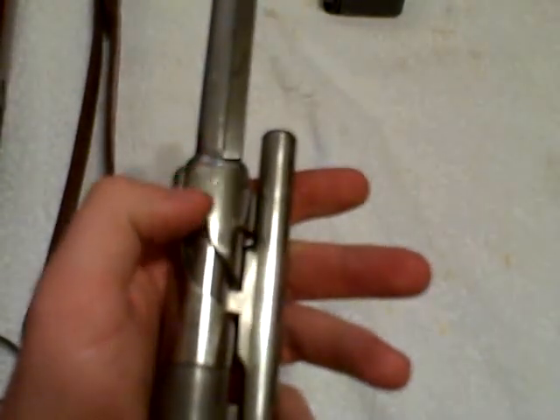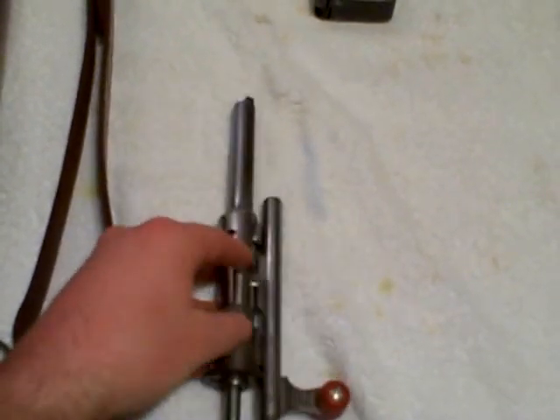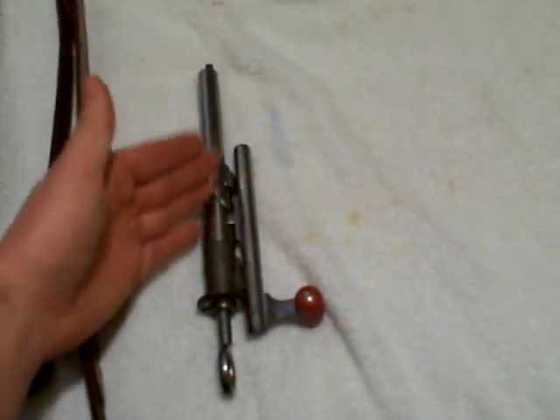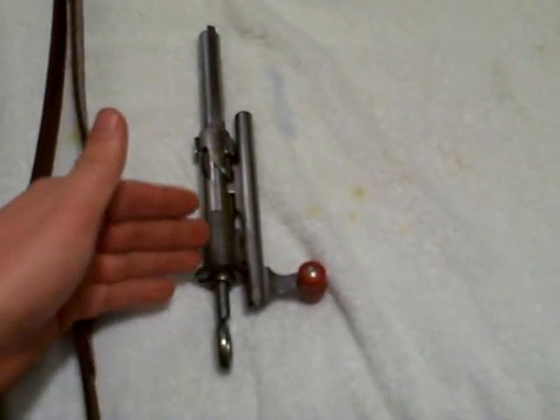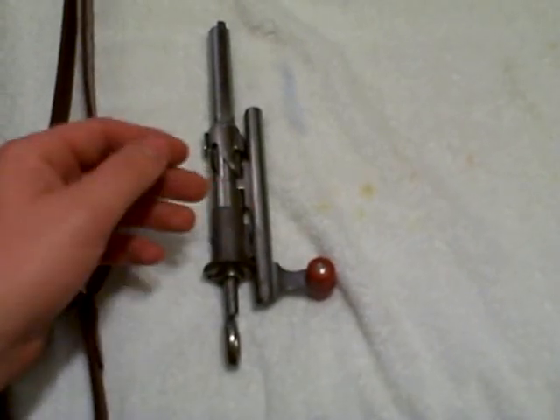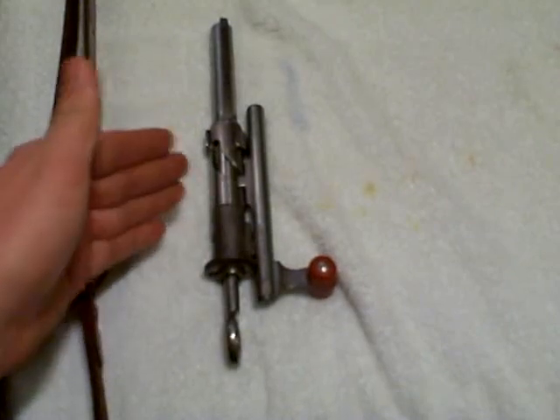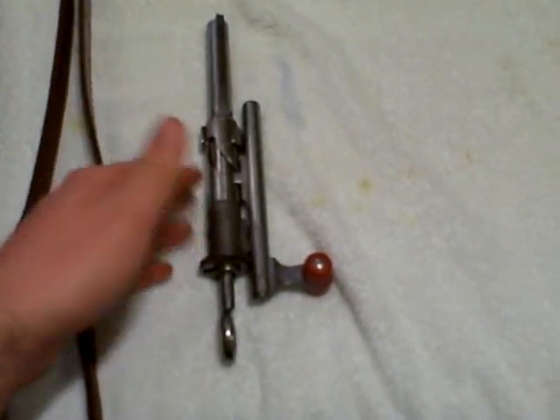Think about these precision machine parts that are fitting together over and over again as you operate or cycle the action. Once they get gummed up with black powder, which won't take very many rounds, that rifle is going to become very difficult to operate even in very sterile conditions. So they moved the lugs as far away from that breech face as they could. With black powder and some earlier smokeless powders, they didn't produce the pressures to make that a problem — it was totally okay to have it back there.